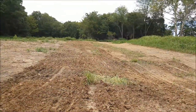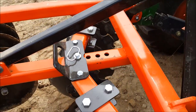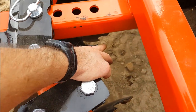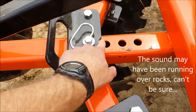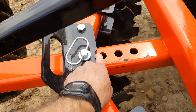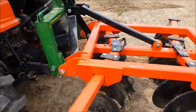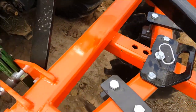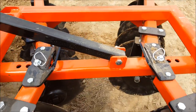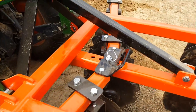Definitely much more aggressive - I could feel it really torque on the tractor more. I think they might have half settings so I'm gonna lighten up just a little. These two inside discs are getting fairly close and it sounded like they might have scraped once or twice. They have a pin hole but also an indent, which I think is like a half setting. I went back one hole on the front so I'm at three and three now, and the front discs look close enough that it shouldn't leave a gap.